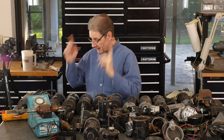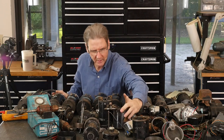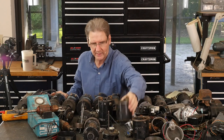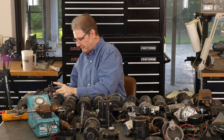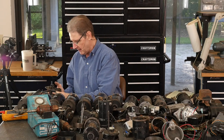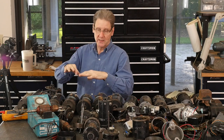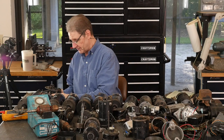So what did I want to tell you? The quick and dirty thing. Where can we find one to show you? I guess right here. We'll rebuild one of these 65As. I think most of you are going to be interested in that. And it's so similar to the 5861, just 12-volt armature and 12-volt field coils versus 6-volt and 6-volt, but similar construction.